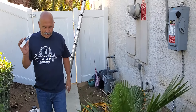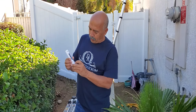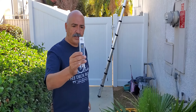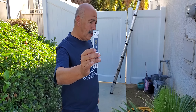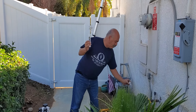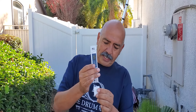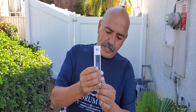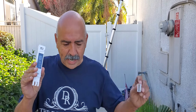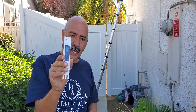All right, so here's our little meter. We're going to check it here. We're going to go ahead and get a little bit of water coming out of the customer's tap and fill up this container. So we're at 233 parts per million — 233. That's city water coming in to this home right here. So we're going to take this out and make sure it's back at zero again.